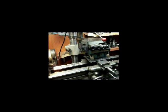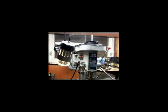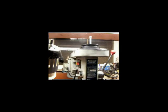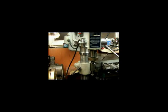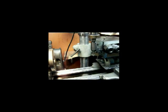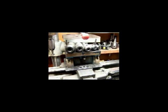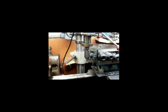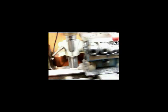This is a 13-inch drill press. What I did — I drilled a quarter-inch hole down the shaft, and I'm going to put a threaded rod in it. In the bottom I put a 3/8 bolt to go into a holder. I have all those holders now — they're Morse Taper 2 and they'll all fit into that hole where the chuck used to go.